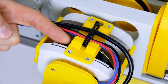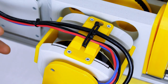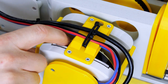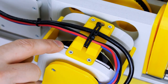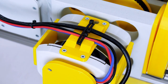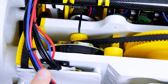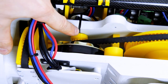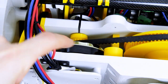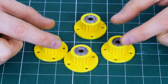Last time I installed these aluminium plates that act as a heatsink and also as a stronger mounting. However, everything's fixed with the same bolts going through the plastic — the four mounting bolts — and they've still got warm and pulled through, so there's a slight gap where that plate has pulled and the motor is still skewed. Every other motor, including the one that actually operates the leg, is double braced: bolted on the back with a bearing in the end and a 6mm piece of steel that supports the other end of the pulley, stopping the motor from twisting and putting load on those bolts.